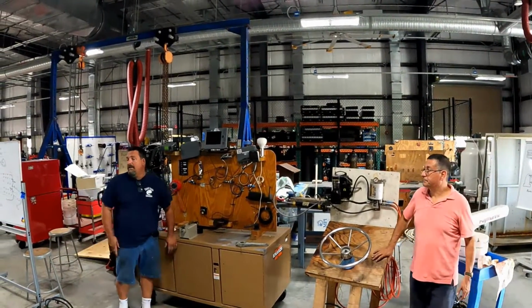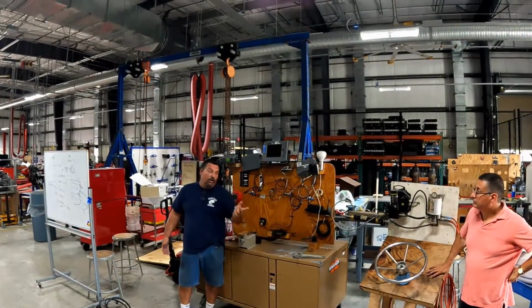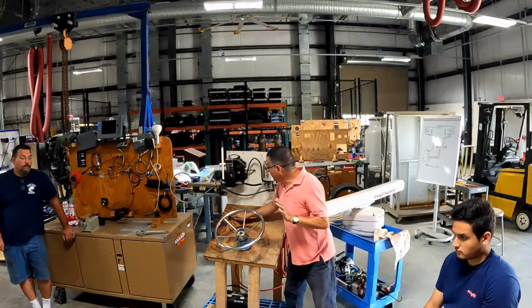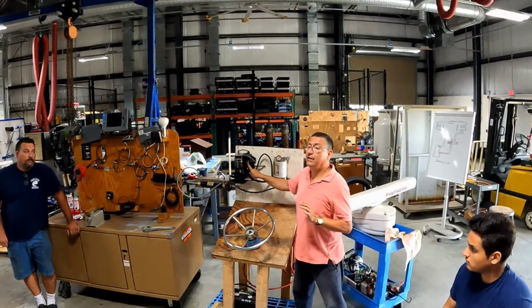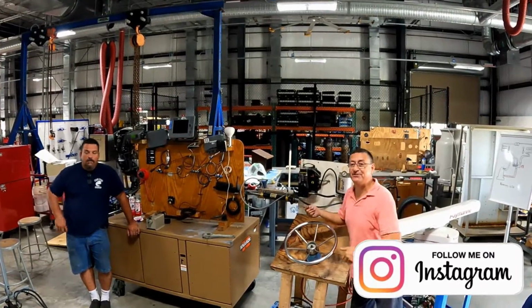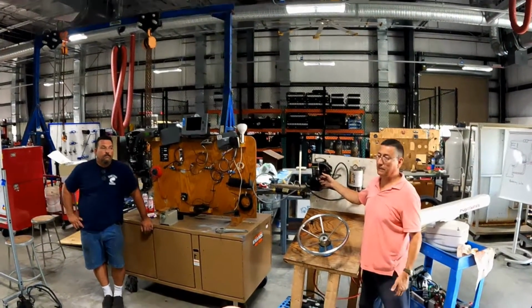For twin applications it's only for the lazy guy who wants the wheel a little bit softer. But for triple engines, it's hard to move 3 engines at the same time, so the power assist comes in handy. In that case, you can install that unit like Danny explained, isolated with a special switch. Okay, I'm going to activate that one. Right now it's activated. It's electrical. Immediately when I move the wheel a little in one direction or the other, that pump helps in that direction. You can move it with one pinky. I move a little here and that one starts and sends additional extra fluid. This is a boost pressure.